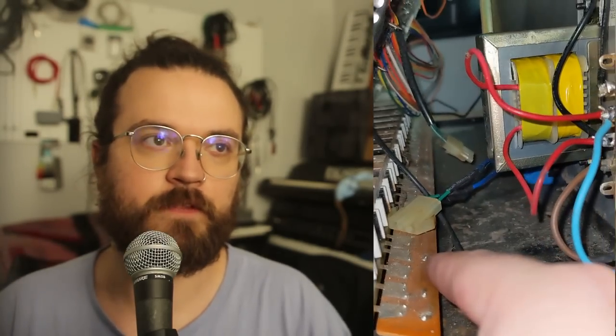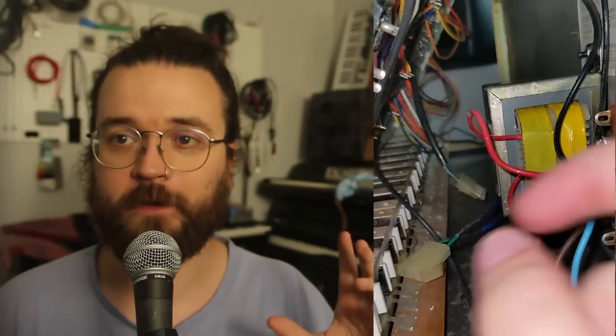At that point, it comes out of the output, which is those three pins on the Tamiya connector I showed you earlier. And again, another safety mention, the fuse is on the live path for a reason. When the current gets too high for whatever reason, a short circuit or a surge, that's the one you want to break. I'm not an expert, and if I said that in a weird way to you experts, I do apologize. But all I really want to get across, the way I understand it, is that yes, with alternating current, in theory, you could swap them, but it's important to make sure you keep them the same, because which one is live is important, because where you put the fuse is important. Okay. I'm going to leave that all in. That's US power all sorted.